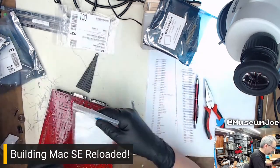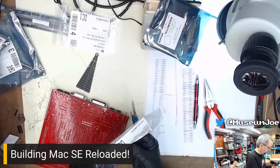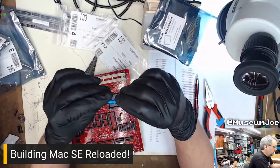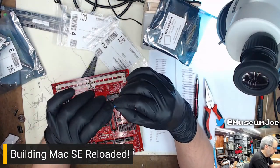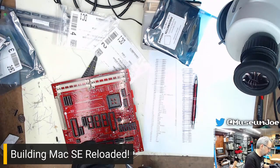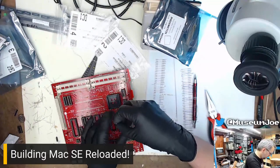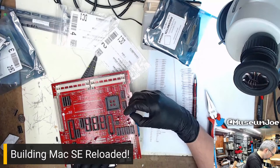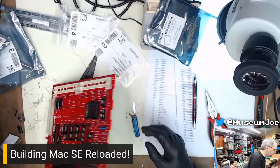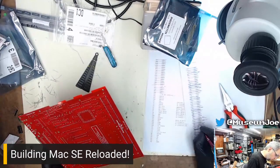You're fine. You're fine. Now these, I was able to get in axials. These are the 1 UF capacitors, which go right, there's only one of them, it goes right here. Memory serves, part of the sound circuit. So the negative is pointing this direction. Yep. So we want this lead approximately there, and this lead approximately there. That is an utter guess. We're going to find out how good I was. I got it. Perfect. Cool. Cool beans. So we are done with those. So that would be this one right here. The 1UF.